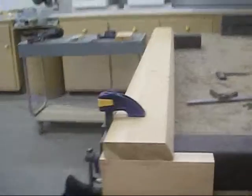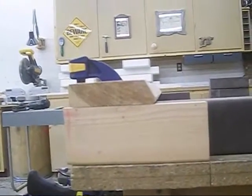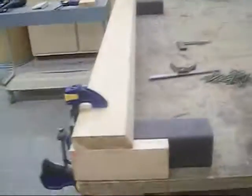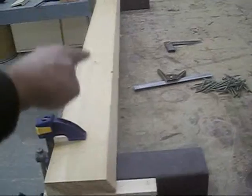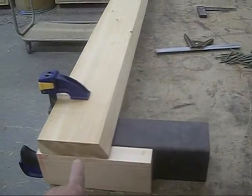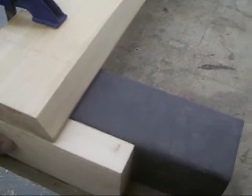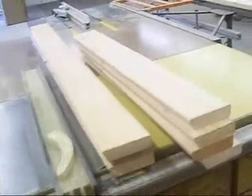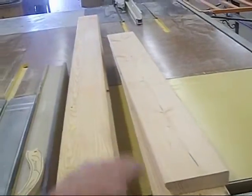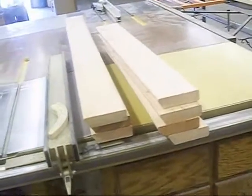The way it's set up now, this would be the top when it's standing up, and I've got the two by six beveled there a little bit so that it doesn't hold water — it will drain off. Since this is the long side, the two by six going the four-foot way will be in between, and that's the reason for the spacer there. You can see it's overhanging an inch and a half, so the short pieces are cut to forty-five inches, which gives a four-foot outside dimension.